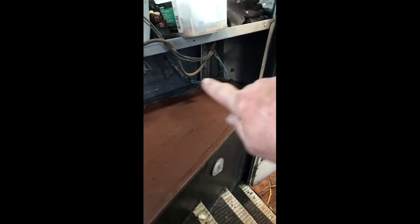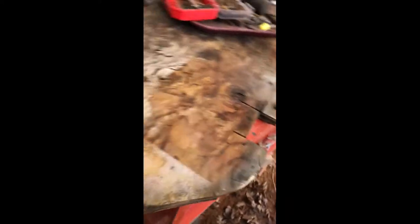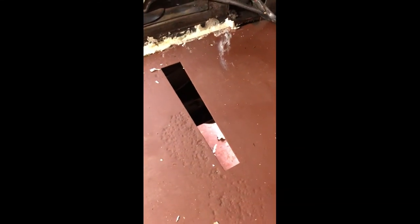To make note, if you have any weird places like this front piece that I have here, save that piece of plywood so that you can use it as a template when you're cutting out your insulation and your new subfloor. This is where the heater sat in the front. Here's the steering wheel and it sat in the front. This is a fresh air intake, so you can get an idea of how far it came out.